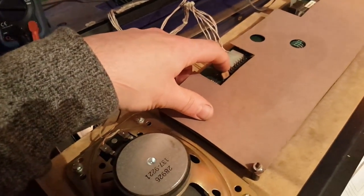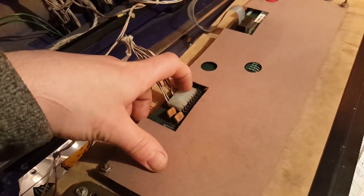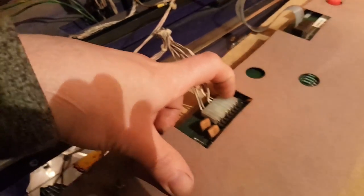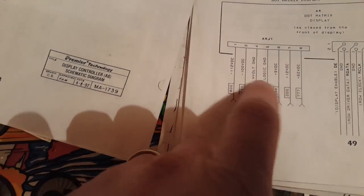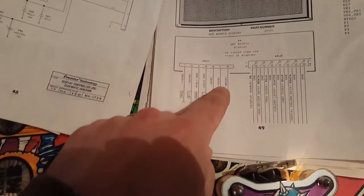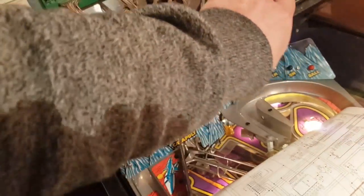Here we have minus 112, that was fine; minus 120, minus 100, that was fine. Then we have plus 5, 64, plus 12 - using the schematic - sorry, 62, plus 12, 5, minus 11 and minus 10. What I noticed is there was nothing on plus 12. So that's a good start - I realized something wasn't working.